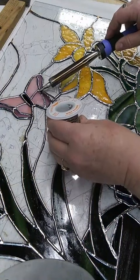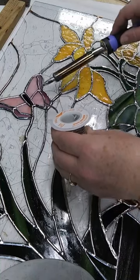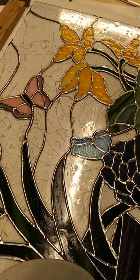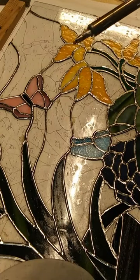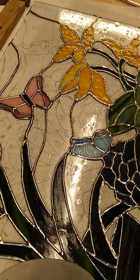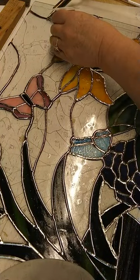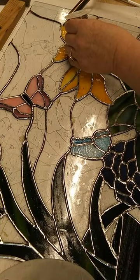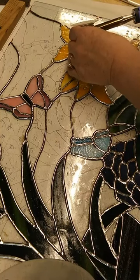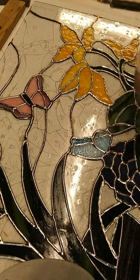Have to run it on the salammoniac block here and see if I can get that tinned nice. Just turned it up just a little bit, so we'll see if I can get the temperature going on it. Going and flowing. I'm holding at an angle just to let that heat build up. There we go. This is more like my speed. Not quite yet. It's not quite warm.